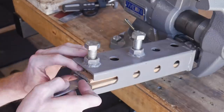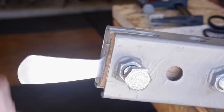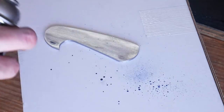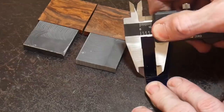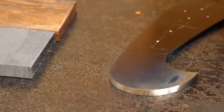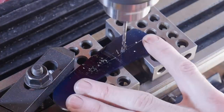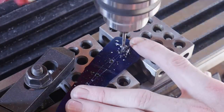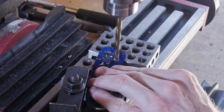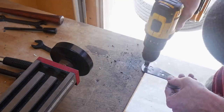I have profiled this blade. I like getting all of the profile up to around a 220 grit finish. I went a little too deep with my small wheel attachment, and I am hand sanding out the hump that was created by getting too aggressive with it. I'm marking off my holes — I'll be using eighth inch pins and some scrap wood from my scrap bin for the handle. To affix these handle scales, I will be using one eighth of an inch brass pins.